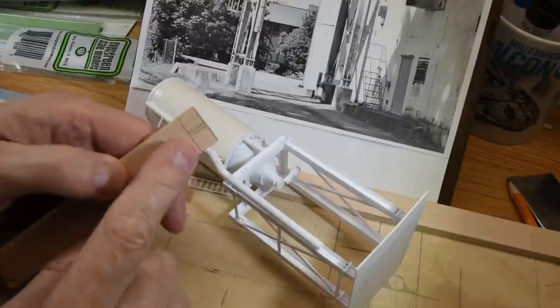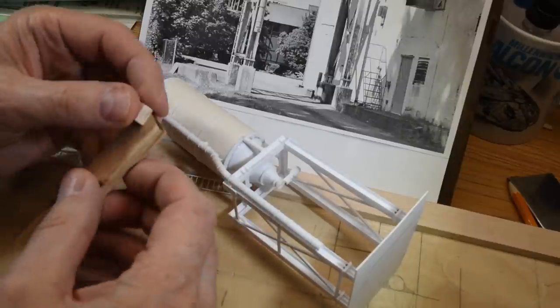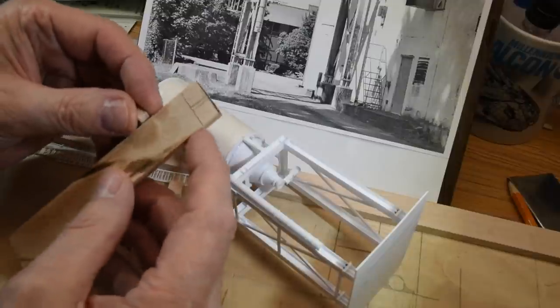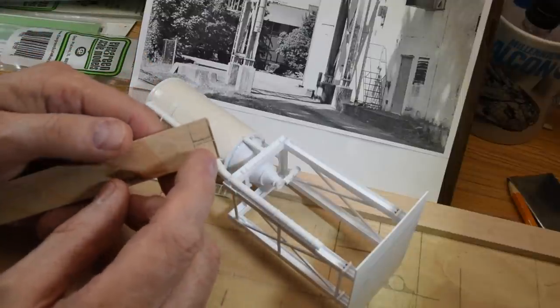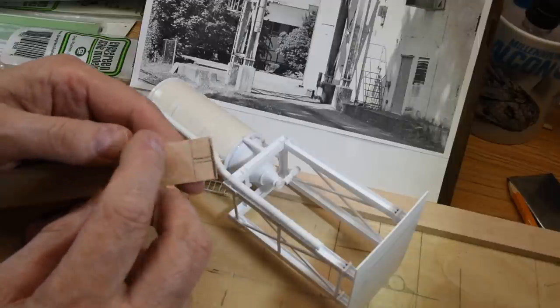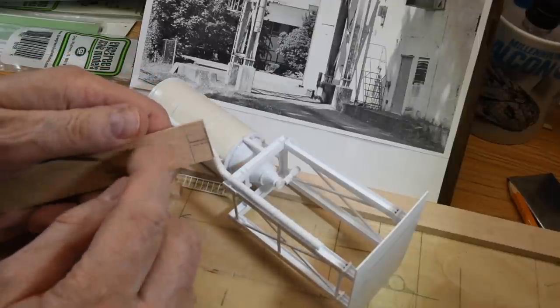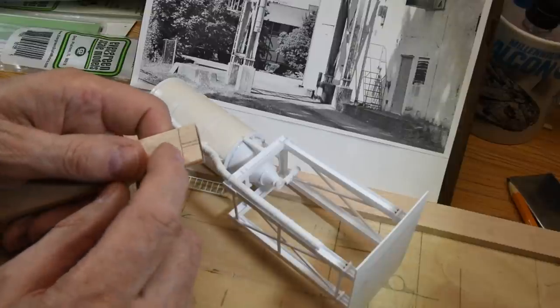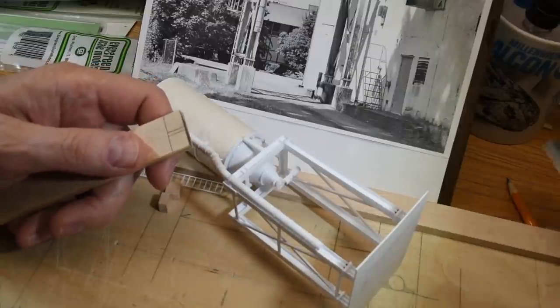Okay, so since I'm on the footing phase, I should mention how I cut these out and why I use maple. I think I might have mentioned that. I like to use maple. In fact, I've used maple quite a bit, like in film, I used lots of it for building model parts. It's just fantastic stuff because it's so dense. It's a little tough to mill for the faint of heart, but you can do it with a razor saw,